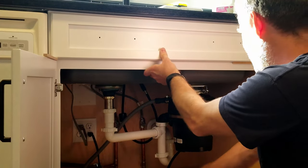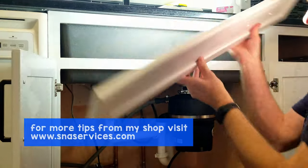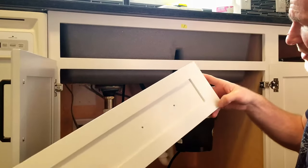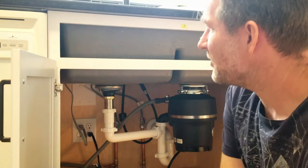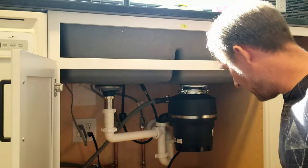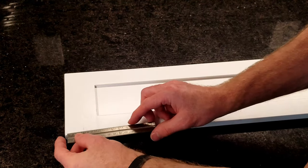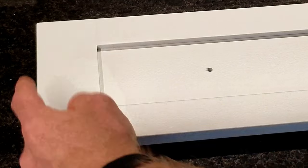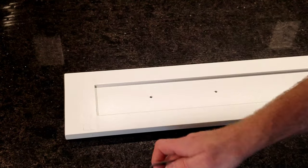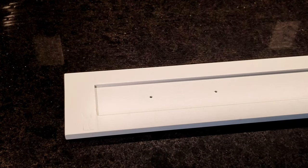Now I have my quarter inch reveal and it's aligned correctly. I'm going to come under here and mark the inside corners of where this would actually be. It can be a little tricky because it is a tight fit. I'm marking the inside corners and bottom corners of the opening for the face frame. Now I can unclamp it, remove my spacers, and you can see right where the corners will be. The hinges will cover up any pencil marks. With an inch and a half overlay, that's how I know where the vertical part is on both sides.